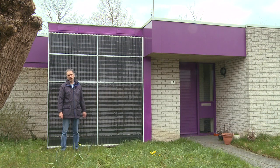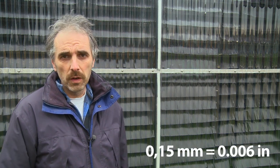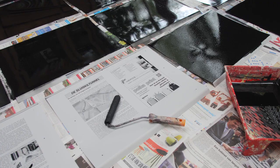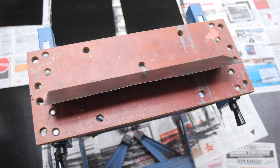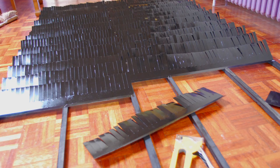This is the second collector I built last year. It's a smaller one — it has only two compartments with two collectors of three square meters each, so it's six square meters as a whole. It's smaller but it's very efficient. This is what I call the Condor collector. It's made of very thin offset printing plates, cut with a household scissor into small strips, and those strips collect the heat very well. I cut them into small pieces — I call them feathers — and they work like a charm.